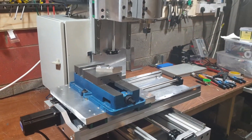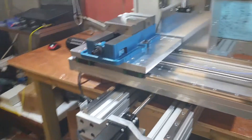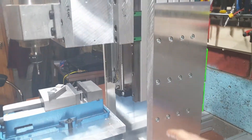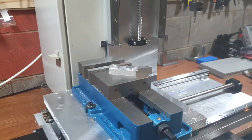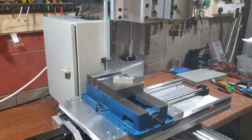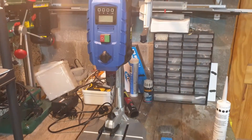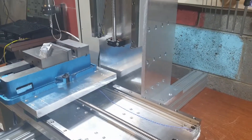That will be it for this video. I will show you a few more things in the next video — I will make a short video about how I was preparing this stuff. All of the aluminum plates, I was drilling the holes, then tapping the threads into the aluminum, and countersinking the holes for the socket head screws. Literally everything on this machine is made by hand. The only machine cutting was for the plates — I ordered them cut to size. Everything else was done by my hands, and some of the cutting was done with my Makita jigsaw. I was tapping the threads with a drill as well.